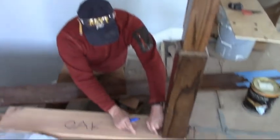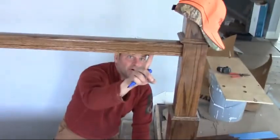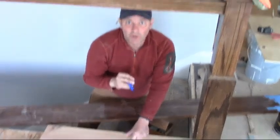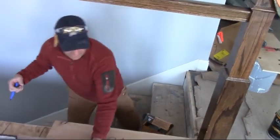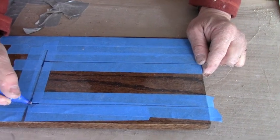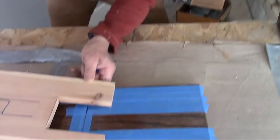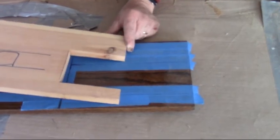Then I'm going to put a shoe rail right here on top. A shoe rail is going to go something like this. And then I can put my 2x2s from here to here, boom to boom, and then another one, boom to boom. But I haven't shown you the shoe rail yet. So first we have to cut this oak board — this super fancy oak board. I've put a few marks on here and we have to get to that corner right there. And we are going to rip it, rip it good so it looks like this and slides in there. Then we might have to lock this side off a little bit, fill this end in a little bit to make it look super nice. And then we'll be ready to go with the shoe rail and start putting in the 2x2s all the way across. That's kind of the plan.